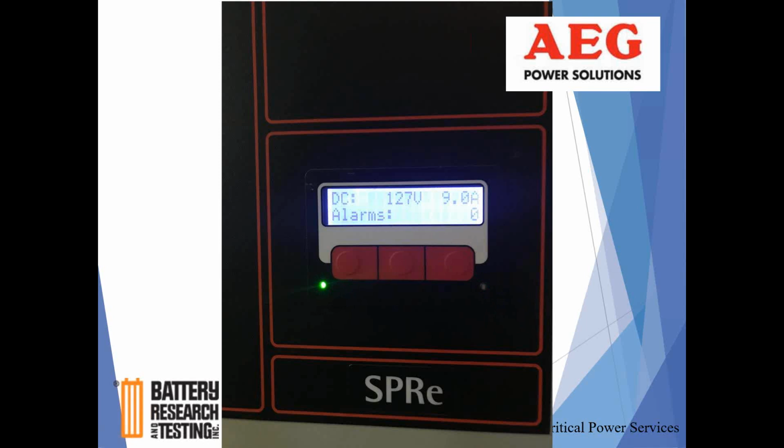It's probably not a bad way to have your system set up, because if you get latching alarms, people may not necessarily know how to clear them. It could cause confusion, thinking that it's active. That's my preference, but from what I've seen, you don't have latching alarms in the field. Almost everything is real time.